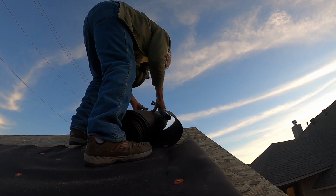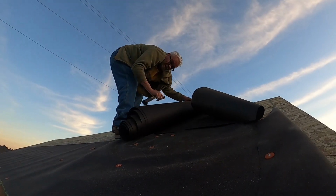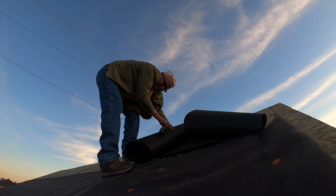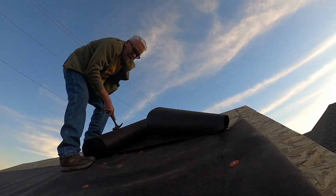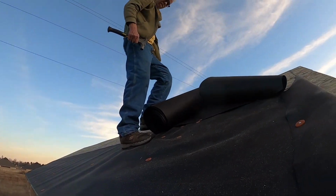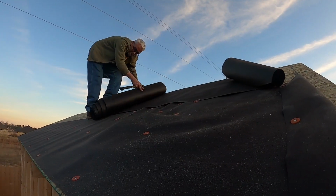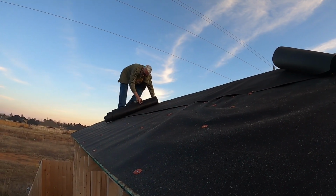And that's titled Old Man Nail. Yeah, Old Man Nail, right. For the paper, it's really not super complicated. Just roll it out and fit it to size. Make sure it overlaps on the ends. And then use those nails with the plastic caps. Pretty easy to hold it down in place.